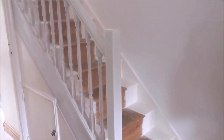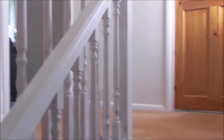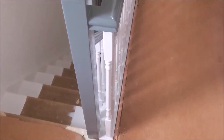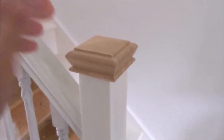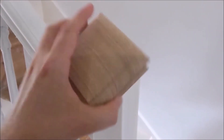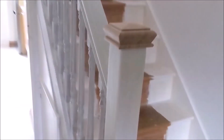They spent an entire day sanding down the stairs. A white paint was then applied twice before a grey primer was added where the black paint was going. The middle of the stairs were left where the runner would be going up. We didn't like the stump post at the bottom so we bought a newel post cap for £20, then glued and put it in before it was then painted.